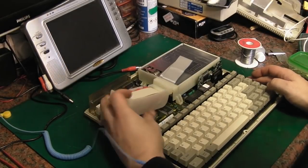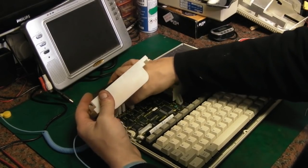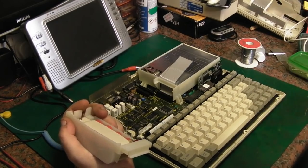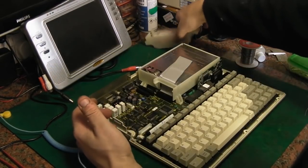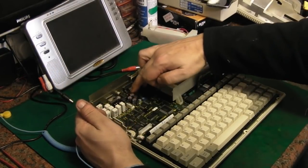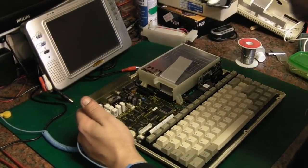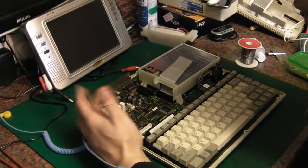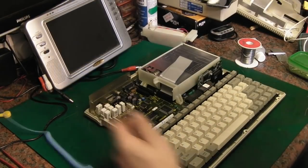We'll get the new battery out — so it was charging it. The light went from green to red, which I think is the charge indicator. The computer fired up and booted. I was just messing about, and then all of a sudden I started smelling that rotten fish. I had a bit of a waft around with a soldering iron, and it's definitely these capacitors here which are the issue.